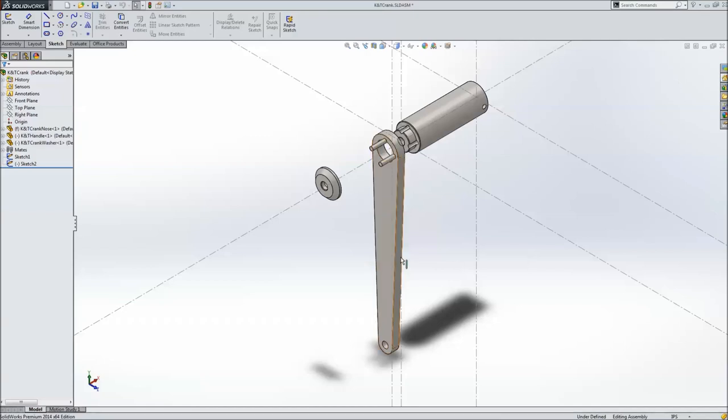This is at least a guide. I am making the handle a little longer than the handle I had on there. The handle I had on there came off the 307 and it was 10 inches center to center distance, and I'm making this one 12 inches center to center distance. So it'll give it just a little more leverage. Not that you really need it, but allow me to get a little finer control over my Z position. So I'm gonna go ahead and print the papers out here for this, and then we're gonna go back over and start making some chips.